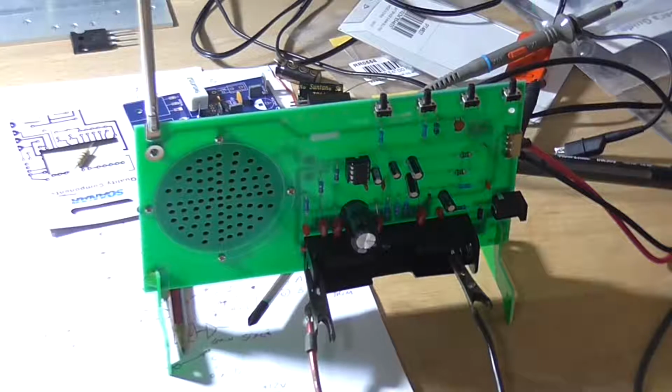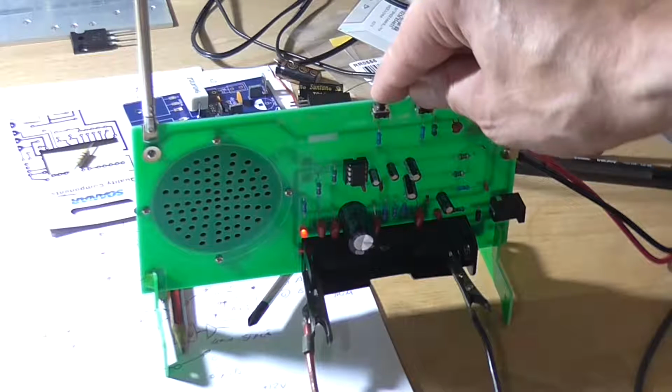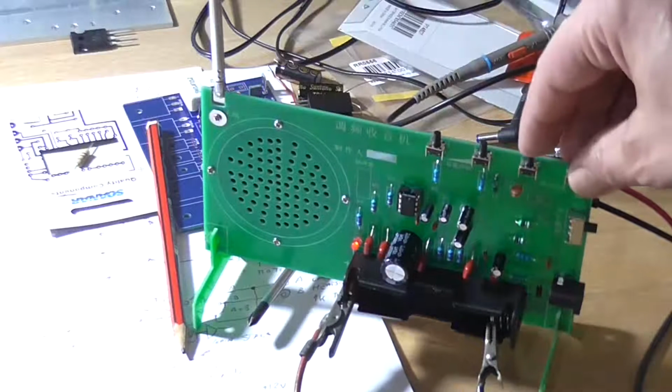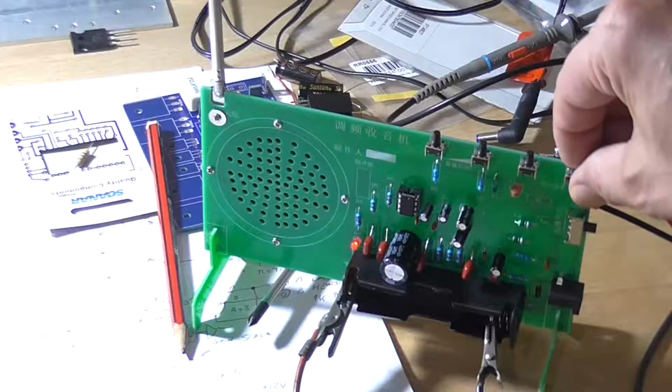So I was looking at the data sheet for the RDA5807 and I was looking at where the crystal oscillator is. Yes, it's 32.768. So I was just wondering what happens if I actually just inject, it's supposed to be a square wave of that frequency, into the chip. Well, it does work. However, the tuning doesn't appear to make it function.